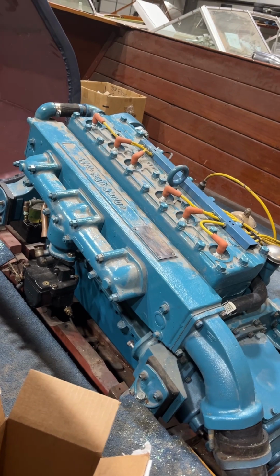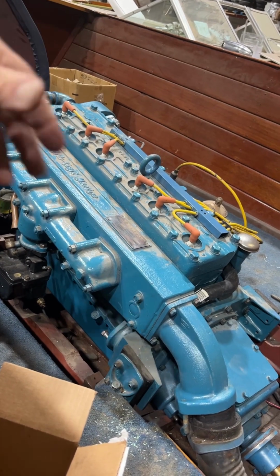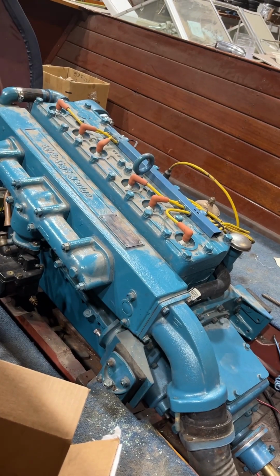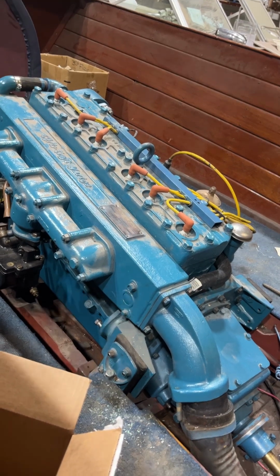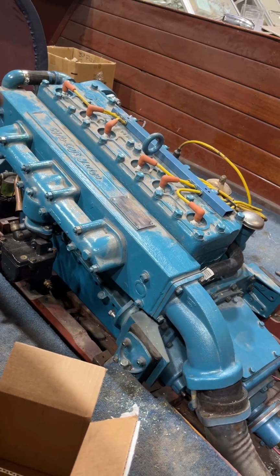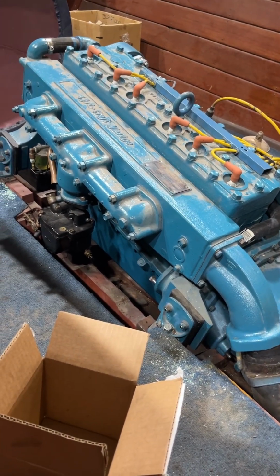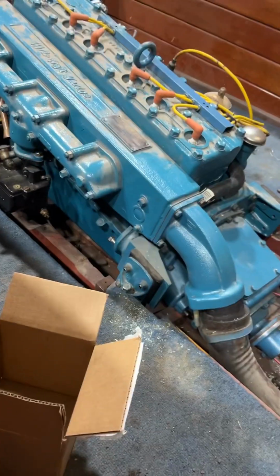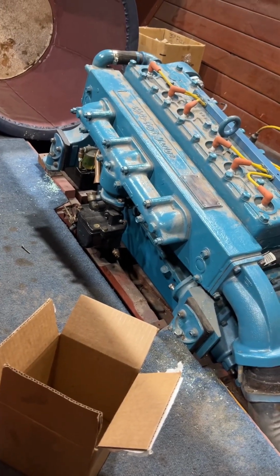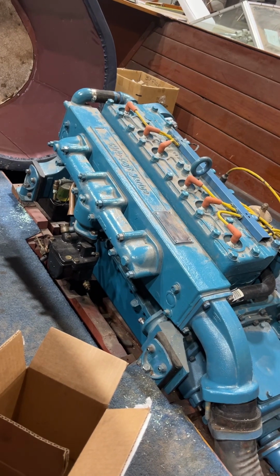and so we spent probably about half of what normally, when you rebuild an engine, is just the machine shop cost on rebuilding the engine. If you rebuild the carburetor and give it a tune-up and rebuild the water pump and rebuild the starter and rebuild the generator, then of course that ends up being about as much as rebuilding the rest of the engine, which is just the block, the pistons, the cam, crankshaft, all that stuff. So we didn't rebuild any of that stuff, we just rebuilt all the ancillary equipment. Because even if you have a running engine, if your ancillary equipment isn't charging the battery, or your starter's not kicking out when it starts, and you're not tuned up properly, then you don't really have a running engine.